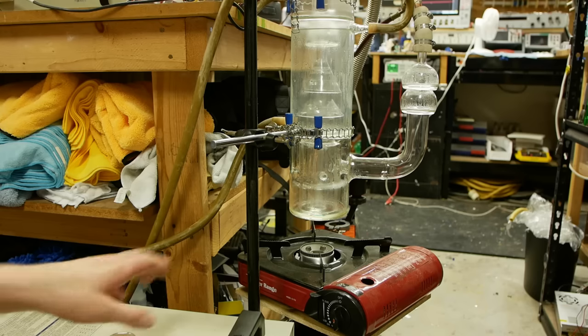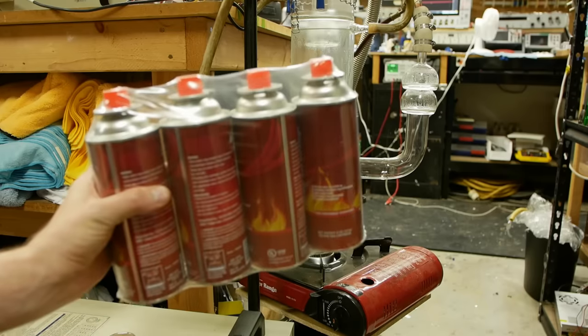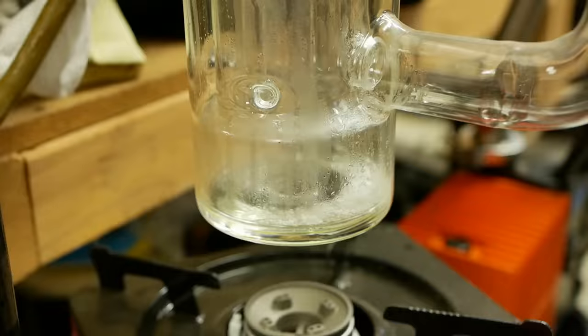We're going to power the whole pump with this tabletop burner — it's a real gas guzzler and puts out a lot of heat, so be sure and buy extra butane fuel. The mechanical pump we're going to use is that large orange pump on the ground. I'm going to turn that on first and let it run for about five or ten minutes to get most of the air out, and then we'll fire up the burner to get the rest of the air out. One interesting thing when we first pump down is it looks like it's boiling, but actually what that is is dissolved gases coming out of the silicone oil. Just lowering the pressure means there's a lot of gas coming out of that fluid — silicone oils are able to dissolve high amounts of gas, which is why you have to degas silicone casting resins. We'll let this run for another few minutes until the bubbling has stopped, and then we'll turn the heat on.